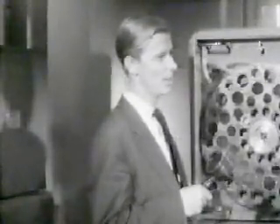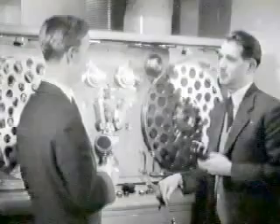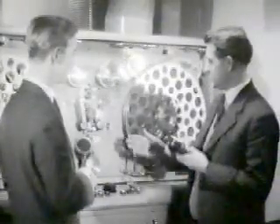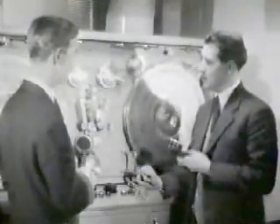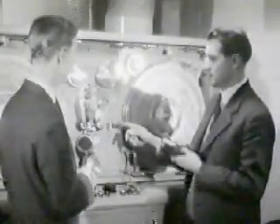So we have seen that you can monitor the pictures immediately, but how long does it take to reproduce the pictures again? First of all, we have to rewind the tape. We have the tape in a condition here for rewinding, and we start to rewind by pressing the switch. This rewinding process takes something less than half the time we took to record. And when we have rewound and threaded the tape again past the head system and started the machine, then our pictures are available immediately.